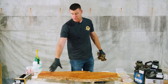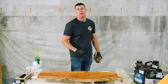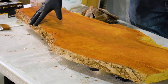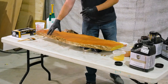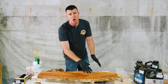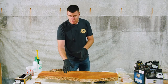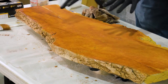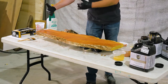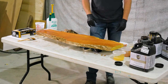We're going to let that drip dry for a bit — if you have a heat gun, hit it with one. It's almost dry; a lot of it is dry. Play the patience game though, because some of the lower recesses aren't fully dry and it'd be a waste to put more color on before that, as you'd disturb what's there. If this were outside it would dry quicker. Also, if you wanted to let that pigment settle at the bottom like we did on the top horizontal plane, you can rotate this piece — put a couple of blocks or bookends to hold it upright and apply your antique coat in that fashion.